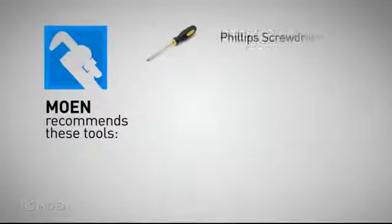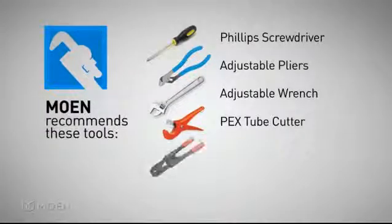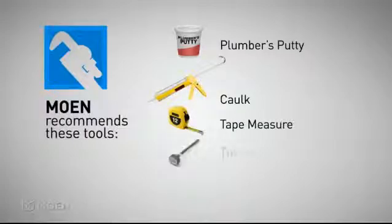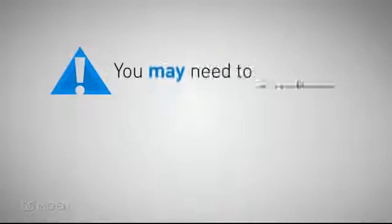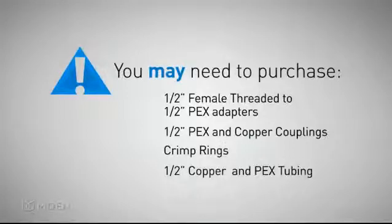Moen recommends using a Phillips screwdriver, adjustable pliers, adjustable wrench, PEX tubing cutter, crimping tool, thread seal tape, plumber's putty, caulk, tape measure, thermometer, and safety glasses. You may also need to purchase some plumbing materials, such as half-inch female threaded to half-inch PEX adapters, half-inch PEX and copper couplings, crimp rings, half-inch copper and PEX tubing, a torch, and lead-free solder kit.